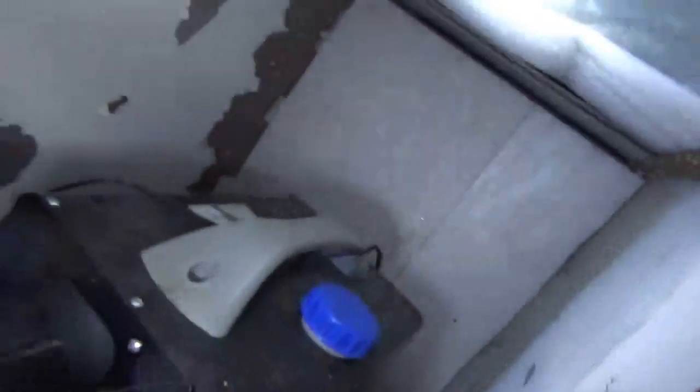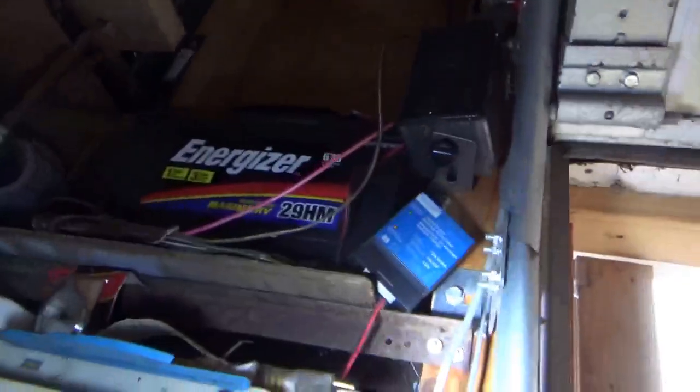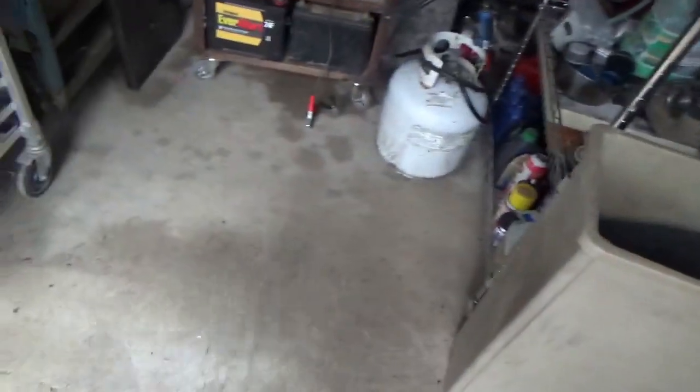You can see metal on the back, sides, and top where I installed it. This is one of the earlier versions where the control was a push button or remote. The air downspout blows right on your feet. I have a battery and a solar charge controller — the sun charges my battery, my battery powers the 12-volt heater, and it blows nice hot air on the floor to keep my feet warm.